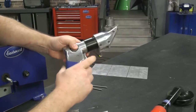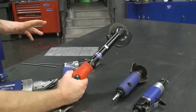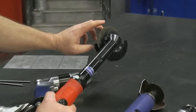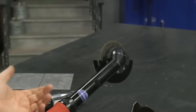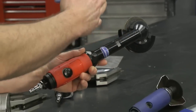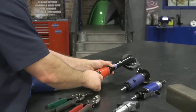The pneumatic shears will cut 20 gauge. We have a cut-off wheel here — this one's pretty unique because of how long it is. Another interesting feature is that you can reverse the direction of spin. Typically they spin one direction, but you can adjust the knob to spin the other way, which is nice. If you're in a tight spot, the length helps you reach in, and switching direction keeps sparks from flying in your face while also making cutting easier.